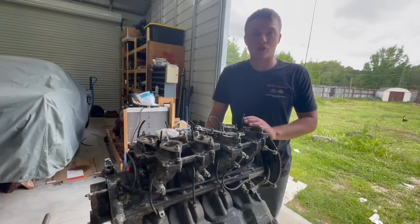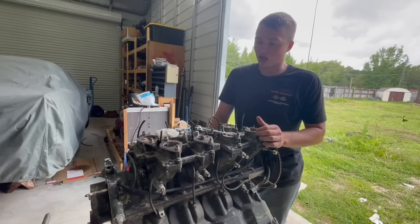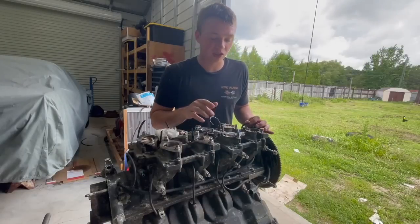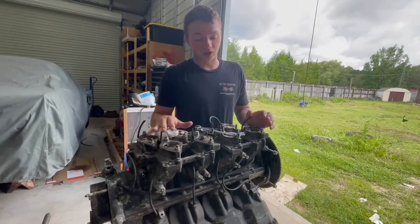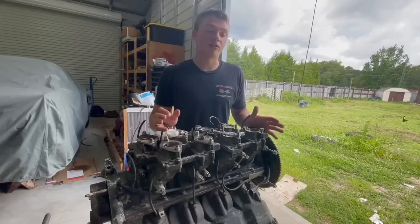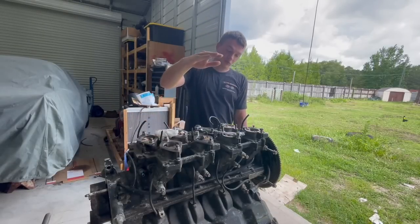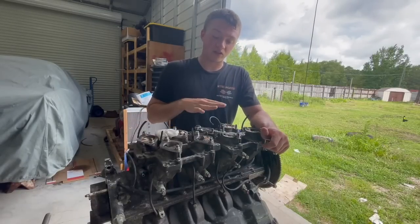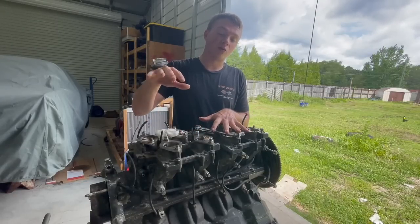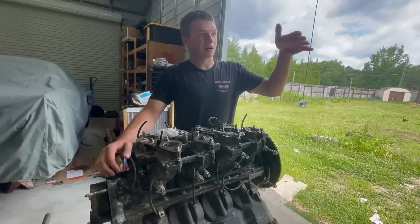I have rethought my idea for this. Sometimes I overthink stuff - the idea I was going to go with was pretty extravagant. I still need each injector at each port, but I was going to do a tube coming up and going into the collector, exactly like a header. It was going to be really tall - the engine would just be too tall and it wouldn't fit. Remember, this is the bottom, so if your whole thing is big, the engine won't fit in the engine bay and would be sticking up out of the hood.